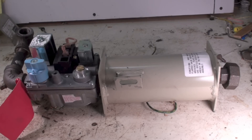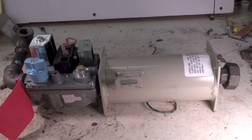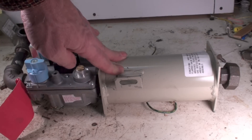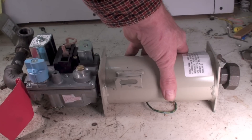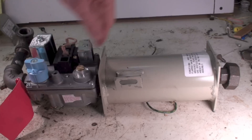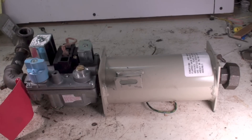Like so many things on this furnace, because it pulsed, it would draw gas and stop, draw gas and stop — probably 60 to 90 times a second or higher. That's going to take out the valve in this gas valve; it's just going to tear it up. So what they did was they put this plenum in here — when it draws gas, it draws from a large volume, and the pressure drops slowly, which keeps from destroying gas valves.